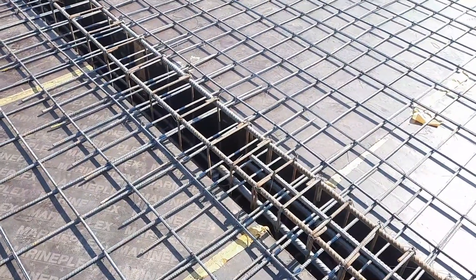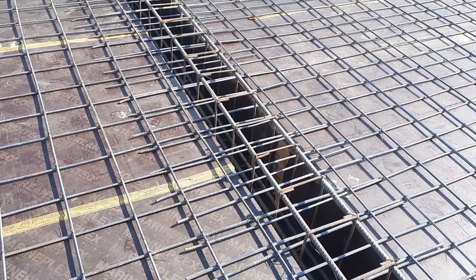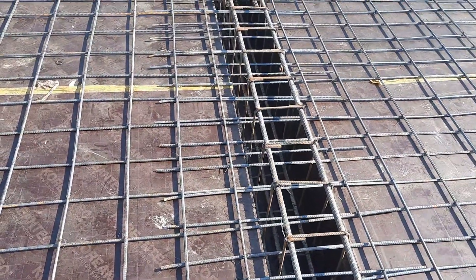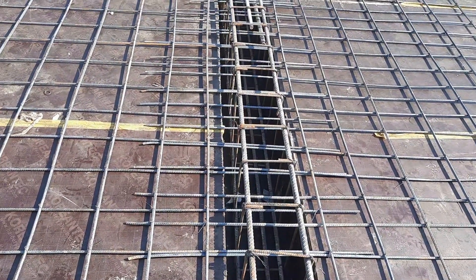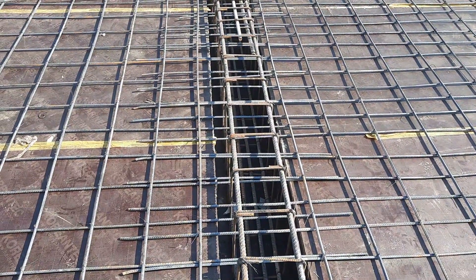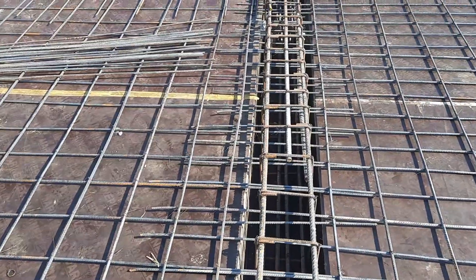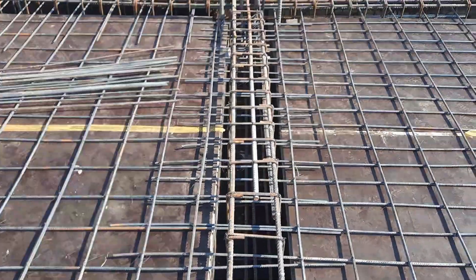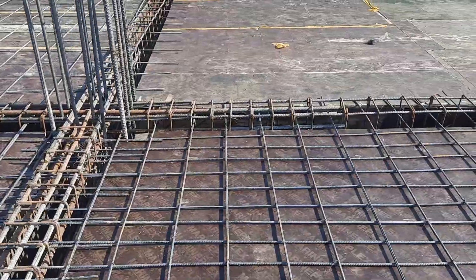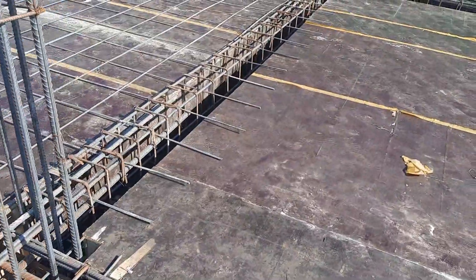If you see, this is floor beam construction. Inside the floor beam, you can see they already placed the slab steel reinforcement. But unfortunately, you can see they placed the lapping length at the distance of L/4. This is one big technical mistake in this construction — here we don't need to provide lapping length. This is the place to provide extra steel rods. This is one technical term.